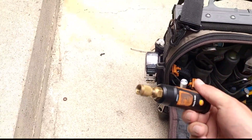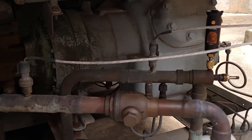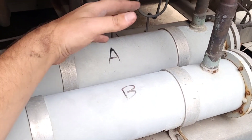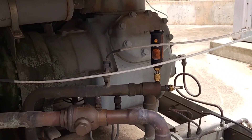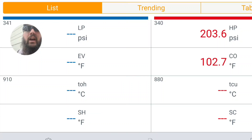Let me get the gauge on. I left my low pressure probe at a building the other day — I need to go back and get it. This circuit will be turning on in a few minutes and I'll be able to check the head pressure. This is circuit A — I also need to verify the sight glass, make sure it's actually clear. It just came on, so I need to switch over and check those pressures. Right now we're at one compressor on and we look okay. The sight glass does appear to have cleared.